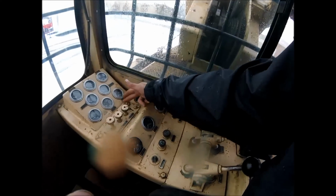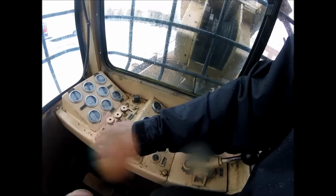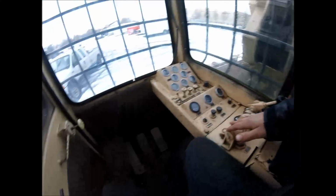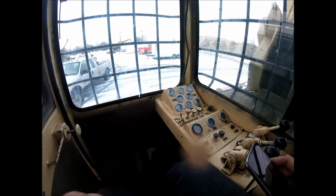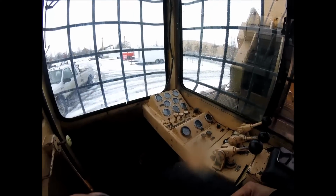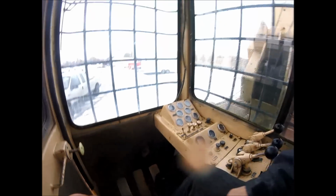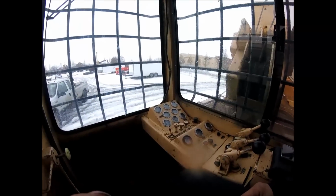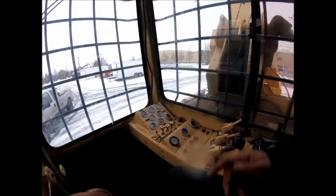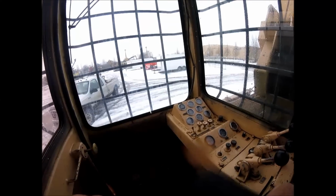And then here's your service brakes for your haulback and your skid line. I'm not sure why there's not a service brake for the Skyline. And then here's this would be your Skyline. I'm assuming that to be user friendly, the right foot would be your skid line. I bet it is, because you can see where it's wore out kind of here and not here. So your skid line is going to be used the most. So right foot's probably skid line, left foot is the haulback, and your Skyline's in the middle. Because like I say, these thinning yarders, you don't do a whole lot of slackline logging with them. So to be user friendly, they'd be set up like that.